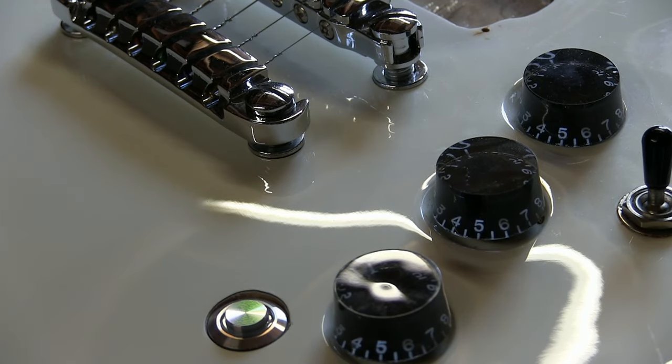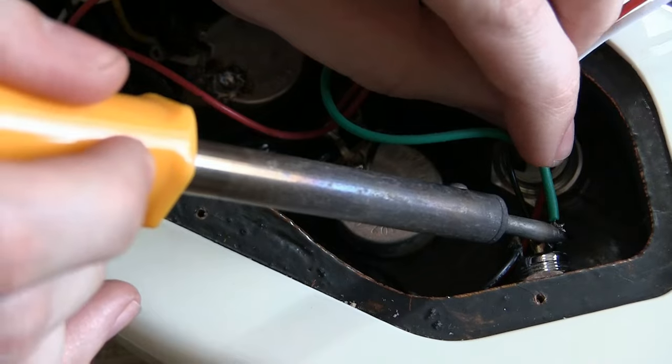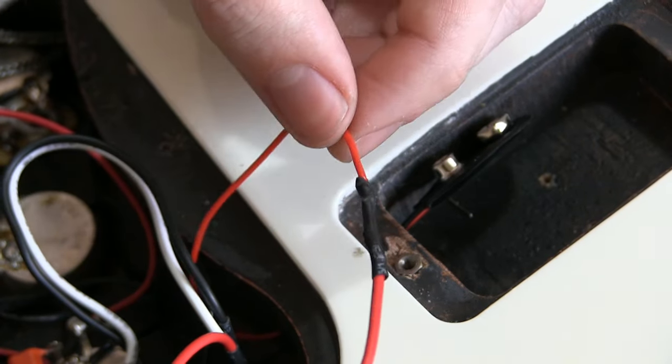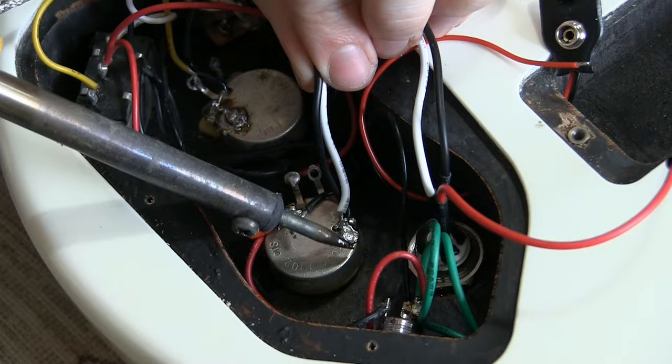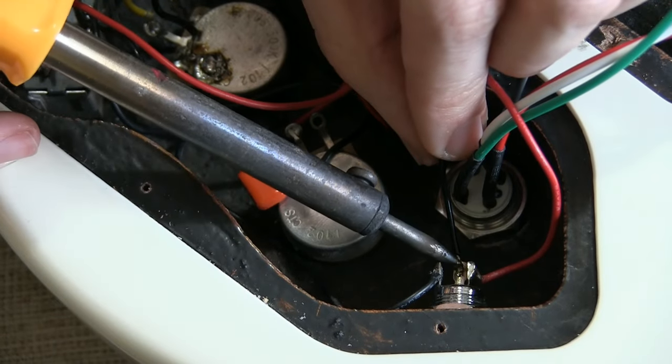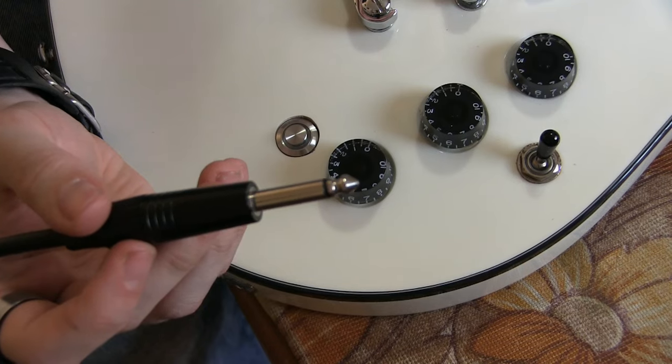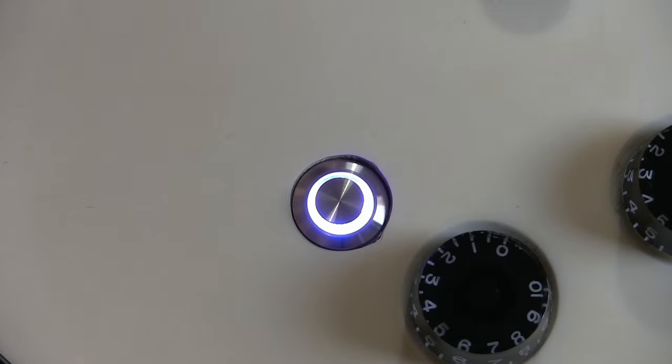Once complete, the switch fits down nice and snug and looks great next to the other recessed controls. Now we move on to wiring things up — I've got a wiring diagram on my website and I'll put a link to that in the description box below. A brief summary: for the four wires coming from the switch, green connects to the hot output of the jack socket; red connects to the red cable of the battery clip with the two resistors in series between the cables; and black and white both connect to ground. That leaves the black wire from the battery clip, which connects to the spare ring lug of the stereo jack socket. This means when the jack plug is put into the guitar it will connect the black wire to ground, completing the circuit and lighting up the LED. If you don't have a stereo jack socket and aren't willing to install one, this is the ideal place to put that mini toggle switch between the black from the battery clip and ground, and that will do the same job.